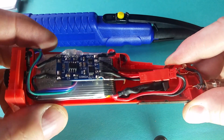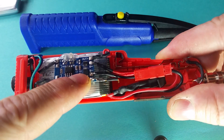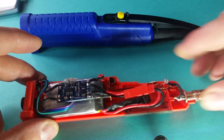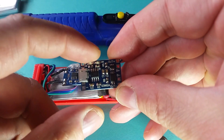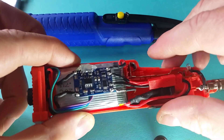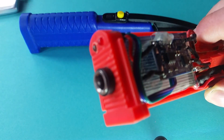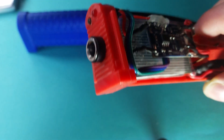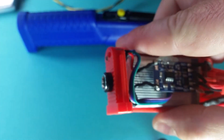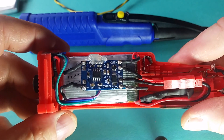I did this first upgrade and I've been using it for a couple of months and it seems fine. I've got the battery in there and a charger circuit on top. I like these charger circuits that have a separate battery output and input. I took the two LEDs off the board — an unchanged board has two LEDs to show when it's charging and when it's charged, and a USB connector on the end. For height reasons I removed the USB connector and the LEDs and put wires on instead. On the back I can show when it's charging or charged, and I've got a connector on the back. If I plug it in, you can see the red LED comes on.